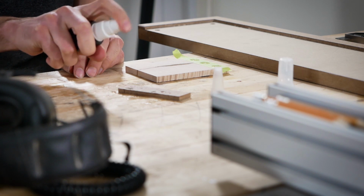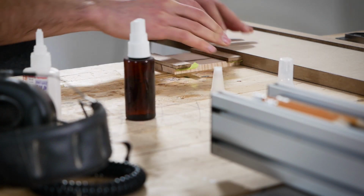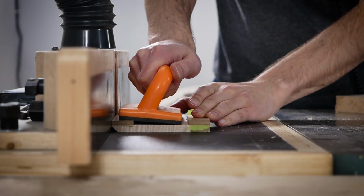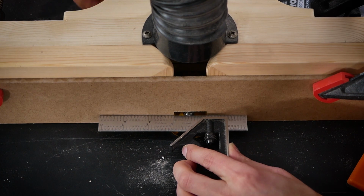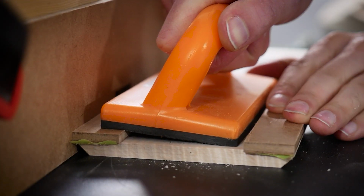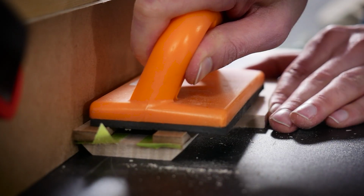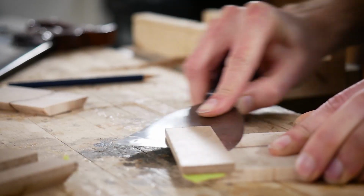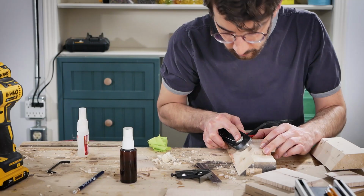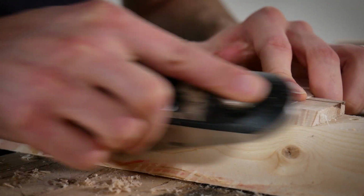I decided I'd use miters for the box joinery and that I'd cut them on the router table. To do that, I had to glue on some temporary hardboard for the router bit bearing to ride against. Unfortunately, I don't think my router is fully trammed vertical in my router table, so I had to go back and adjust the miters with the block plane.